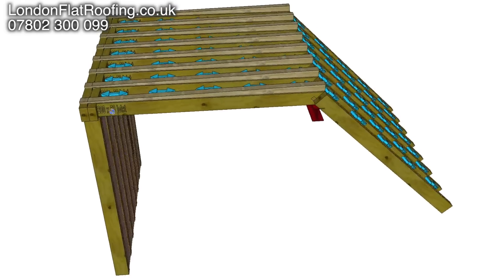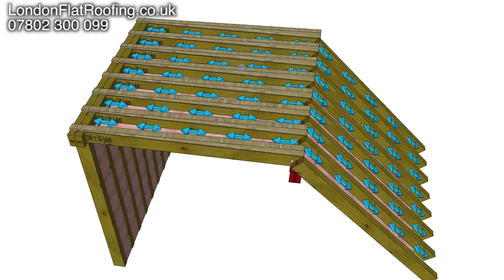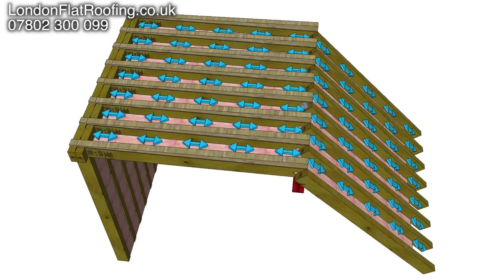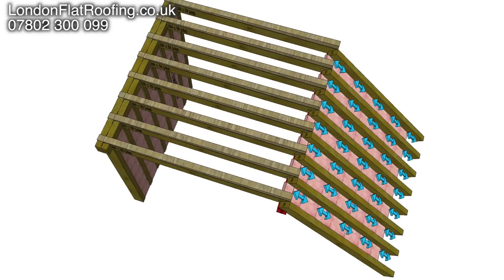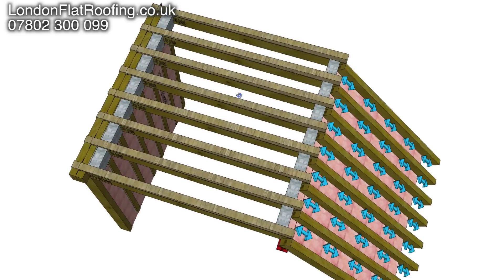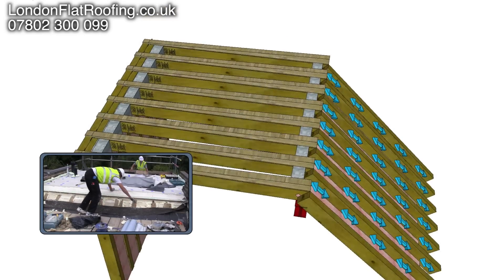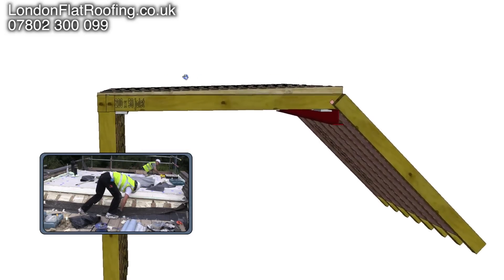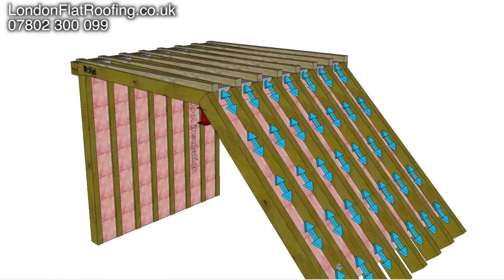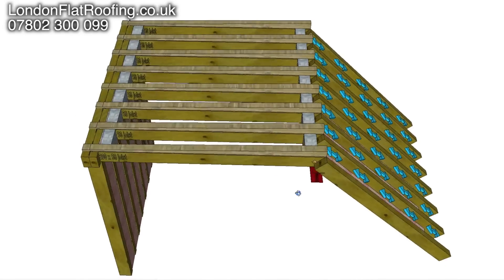What we had to do on our particular roof is to put a warm roof on over the top here. To do that, we removed the insulation from the top area here. But we then put insulation down the side here and here, blocking the movement of air up and in. So the first thing we did was to remove the insulation from between the joists by pulling it out either side. Then we put in this insulation here and here, so that we stop any movement of air coming up and going through into this void. That is something that a lot of people miss, because we're going to be putting our new insulation over the top of all of this. And if we hadn't blocked that area, this movement of air would come up and go back in there and just run around, and the insulation would be sitting like a top hat on the top — it just wouldn't work and wouldn't perform at all, and you'd get cold.